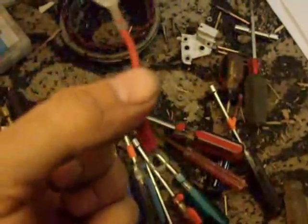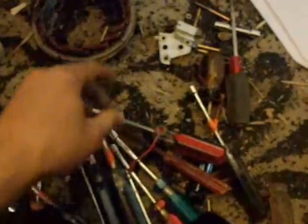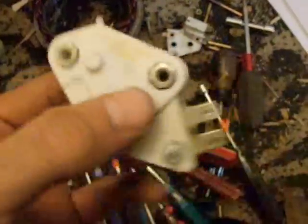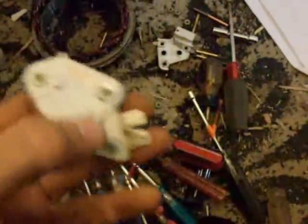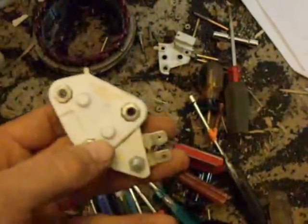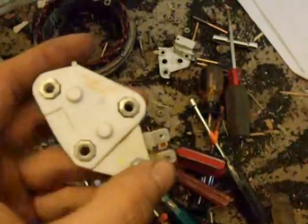You can pick that regulator up and it comes with the wires. It also comes with a little piece of paper with details on where to put everything. Because when you install the regulator, your insulator is going to a little different place than normal. Normally this one and this one will be insulated and this one will be grounded. But with this one, this one and this one is insulated and this one is grounded. That's the difference you got to remember.